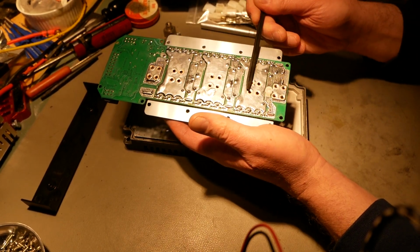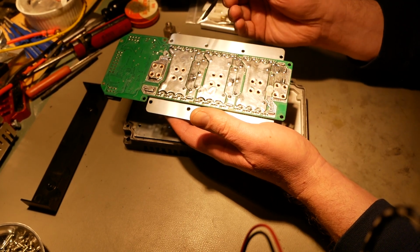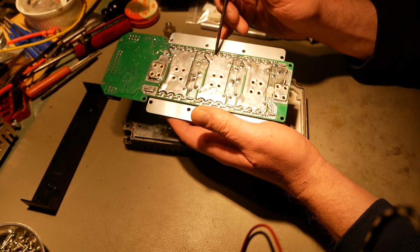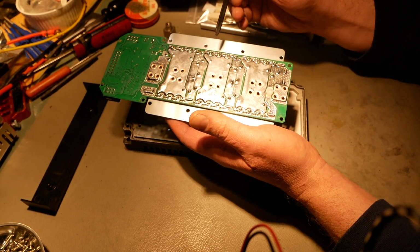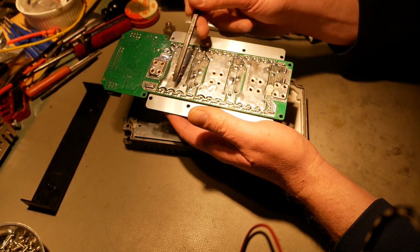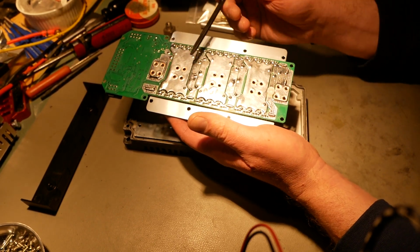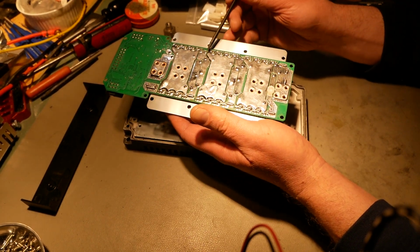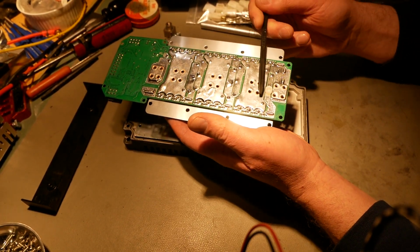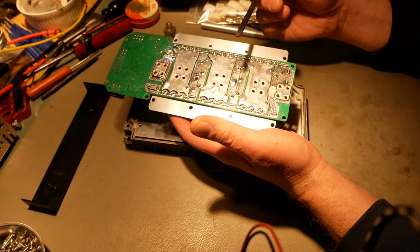And then, of course, the phase buses here, here, and here, same thing. This is very similar to what Nucular does. You can see those little nubbins that come out and come right up to the MOSFET legs. This is the high side, and this is the low side, and here's your copper bus for your 3 phases. And again, that's more 2mm copper, and it goes right up to the MOSFET leg. So this is all very low loss. Yeah, really good current path here.